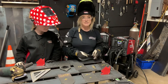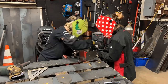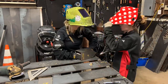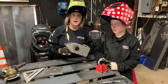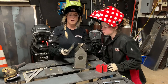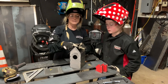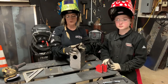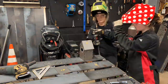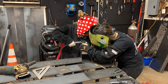We're going to start by attaching the sides to the front and back of the birdhouse. All four walls are now tacked up. Now we're going to add the roof — our two five by five inch pieces. Keep in mind the roof is a half inch longer than the actual width, designed so it goes flush with the back and gives a half inch overhang. When you do the top weld you'll need to weld it all the way through and then grind it off and make it look pretty, because you don't want it to leak inside.